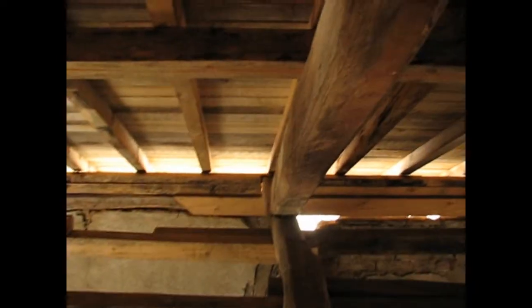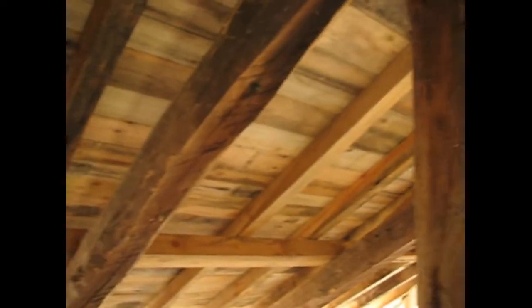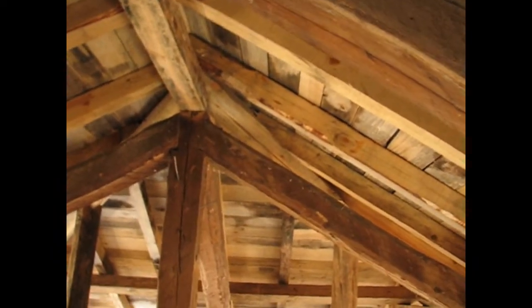This is a new roof that we put on last year, so we're not really going to find problems as much as we're going to show you what we want to see. Basically, this is all pine. Over here, many of the old roofs would be oak — this beam, for example, is oak; the rest is pine. You must walk only on the beams. Many of these roofs have cob between the beams holding up the ceiling. Do not stand on the cob — stand only on the beams themselves. A quick look at this roof tells me there is a water barrier, a hydro insulation that goes under the tiles. You can see it — that's the boards above me. That's the proper way to do things, and it tells me I can safely walk on top.